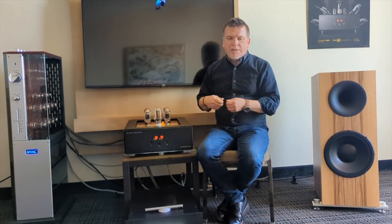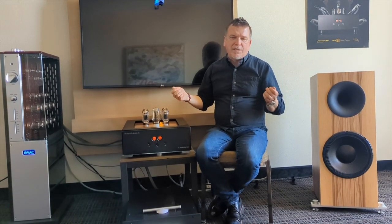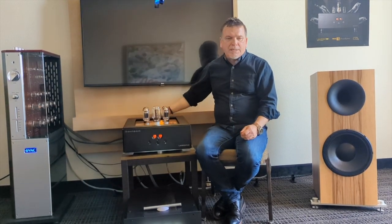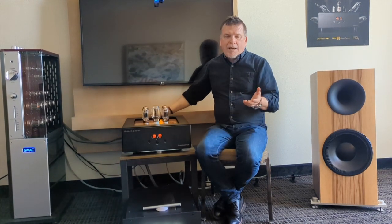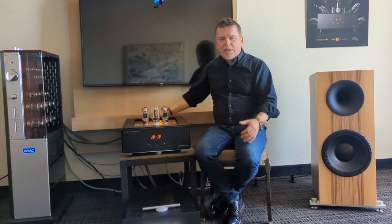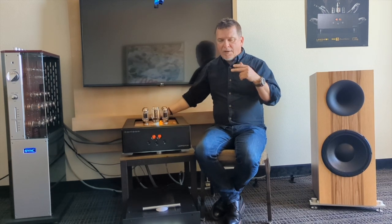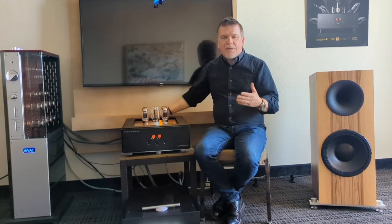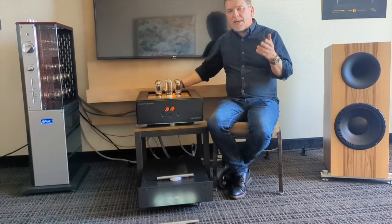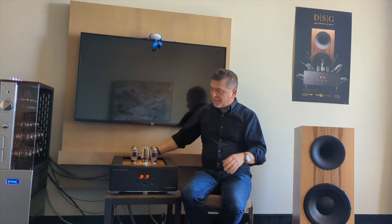If you have a crimping tool, you can take any cut Cat 6, Cat 5 cable, especially the plenum ones with Teflon insulation. You can crimp the plug and use it as a convenient link. Having said that, I2S will not allow us to play DSD. DSD requires a lot more than an I2S connection, so we need muting flags and we need DSD format indicators. This can be achieved only in a USB module that has all the intelligent firmware designed to take care of pops and clicks and clock changes and format changes. So I2S I would recommend for PCM, especially high resolution, but generally don't expect magic. This is not a better format, it's just an alternative.